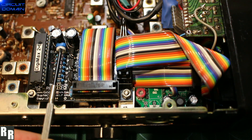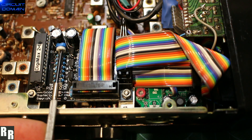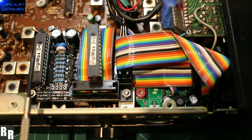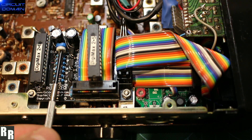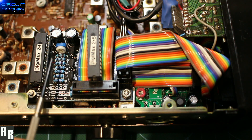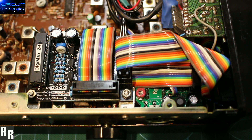You will need to readjust your squelch adjustment. For this particular radio, I had it literally on 50% setting with the previous firmware. For this firmware, I found somewhere around 70% — as I turned to the right, about 70% is where the correct setting was if it was at 50% with the previous MCU. That's the only hardware adjustment you need to make; the rest is all straightforward software changes.